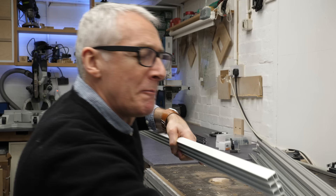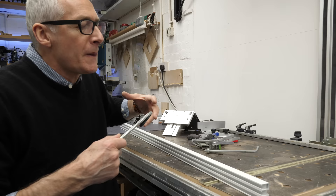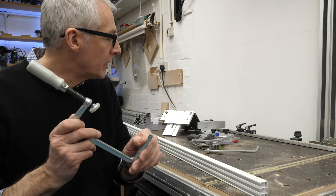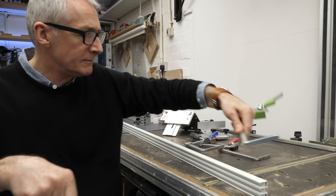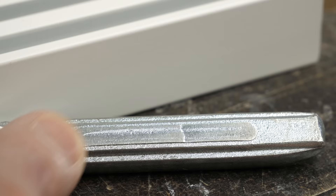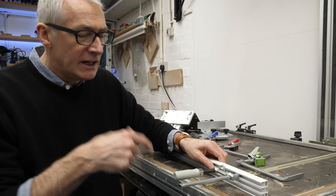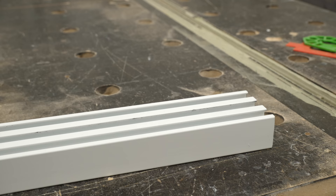The problem comes at the front. One of the benefits of the MFT is that you can use rail clamps through the extrusion on the outside. You can do that with this IKEA curtain track, but there are a few provisos. My Festool rail clamps don't work well with it — neither the regular clamps nor the fancier lever clamps — because they have a little bump on the inside surface of the clamp, and because this extrusion is so thin, when you put the clamp in and clamp it up, it actually clamps to itself rather than to the extrusion. You can just slide it back and forth — it's not clamped.